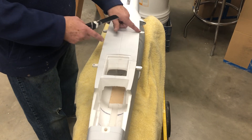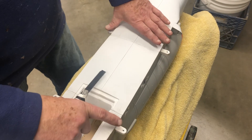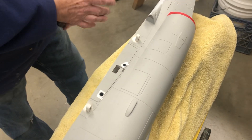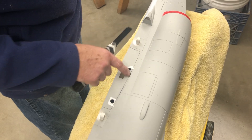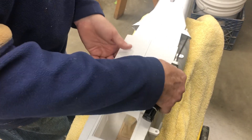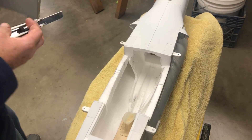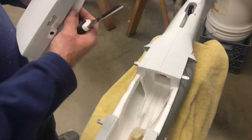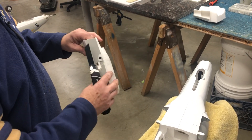You glue it back together with Gorilla Glue. I cut out the bottom here — a cut about an eighth inch away from the nylon piece on both ends, so I did not disturb the parts that actually hold the wing on. The only parts I'm really disturbing are the two spar sockets. I cut once again an angle here and an angle here to create a little bit of draft, staying away from the line where the wing matches up so you don't see the joint. This piece just popped right out. I cut this on an angle — probably about a 25-degree angle on both sides. When I popped it off, I still had a chunk left in the model, so I cut that out also and glued that to the first chunk I cut out. The parts fit in exactly.